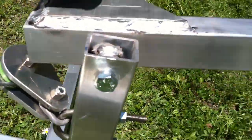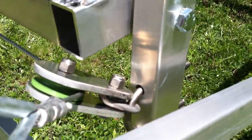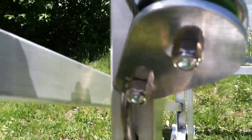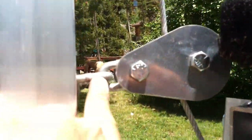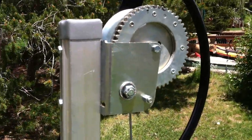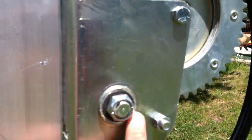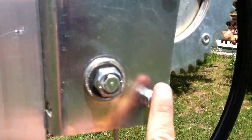Then you can put the cable with a U-bolt on the opposite side of wherever you want the winch. Put one pulley with a U-bolt and a single chain link on the leg. Cable runs across parallel to the bed frame. Put another pulley — again single chain link here — and then another pulley with a double chain link here; that rotates the pulley another 90 degrees. Make sure when you run the cable the first time that it goes behind this bolt so it's going straight down here rather than around this — you'll eventually saw through that pin that's opposite this bolt.